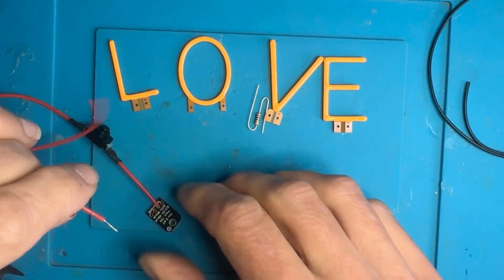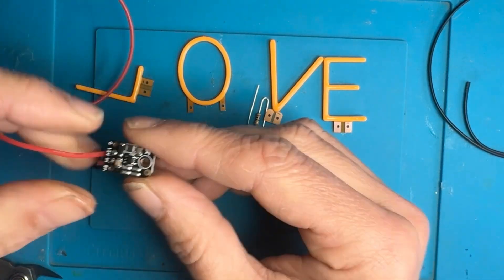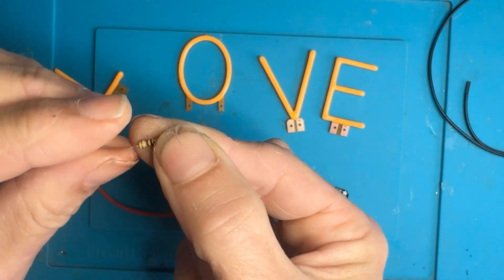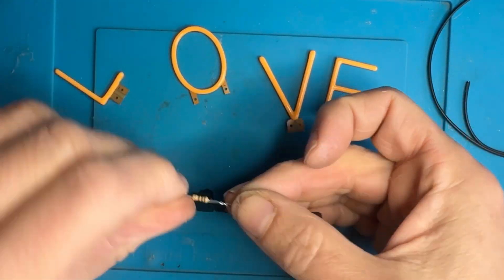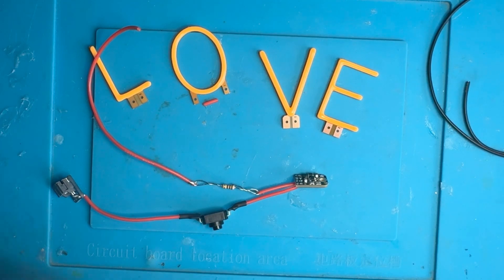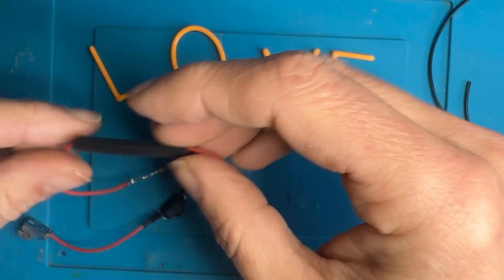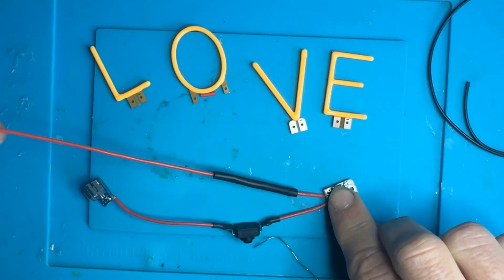Continue with the red wire coming out of the 12 volt hole, then connect this wire to your resistor. I like to twist little loops in the resistor legs to make it easier to attach the wire. Resistors can go in either direction, so don't worry about whether you have it the right way. I like to cover the whole thing with heat shrink to keep it safe.